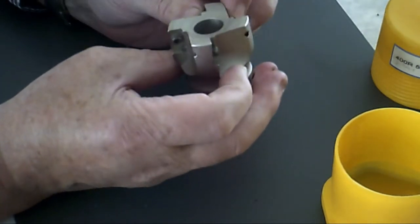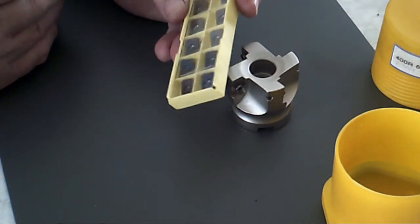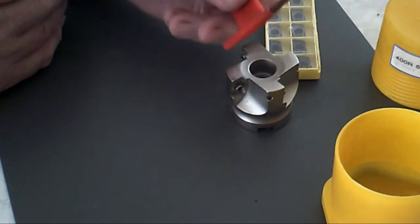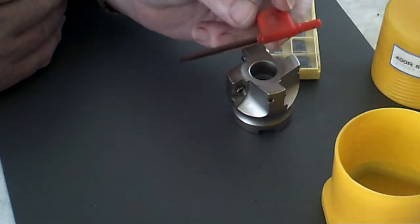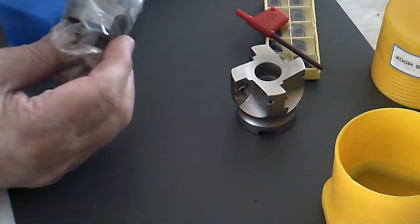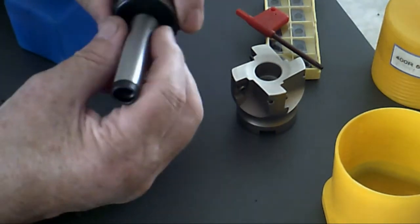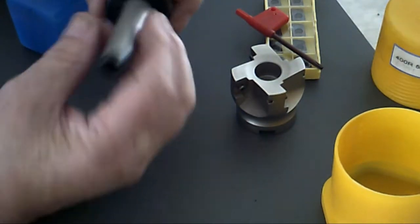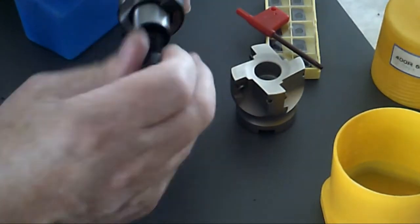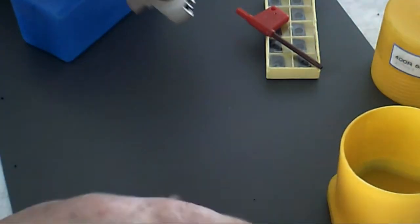It's a very, very good solution. I'm going to show you what you get in the kit. You get a set of carbide tips - APMT 1604s - you get the wrench which allows you to put the tips on, and you get an arbor. The arbor is a Morse taper arbor with a 10mm thread for the drawbar. You can get Morse taper threes, you can also get R8 type. It comes with an Allen cap head bolt which you'll need an 8mm Allen key for.